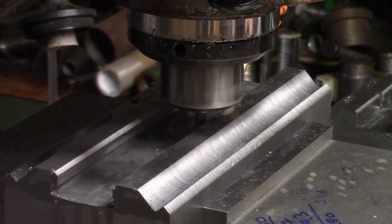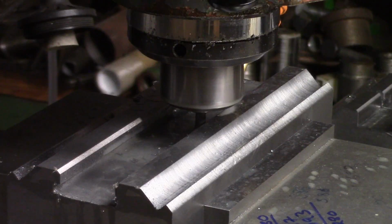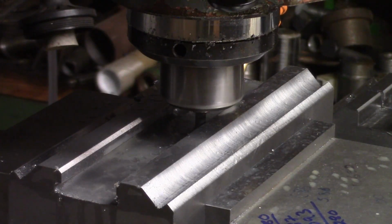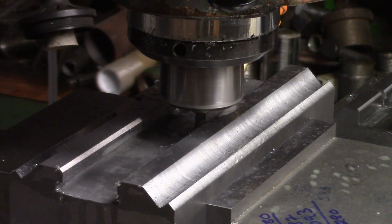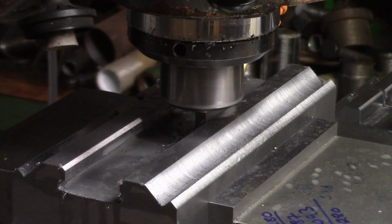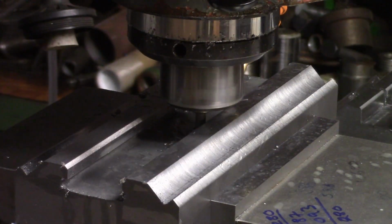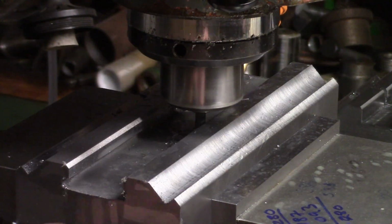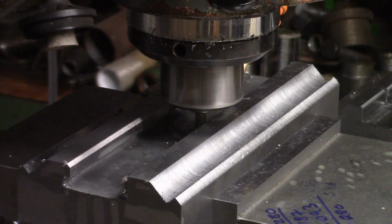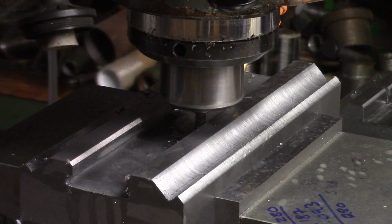Got to run in roughly 515 thou either side from centre. And we're at now 400 thou. So there's another 115 thou to come this way, and obviously the same to the other side. But we've already chopped a good bit out there on the other side, so anyway, we'll see how she goes.